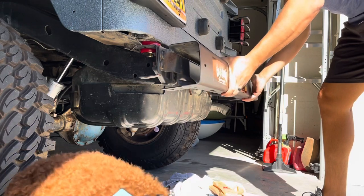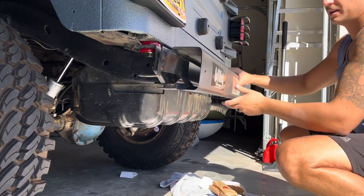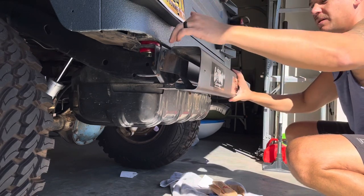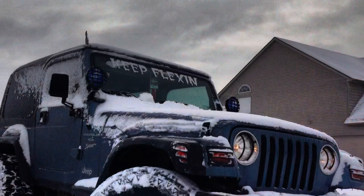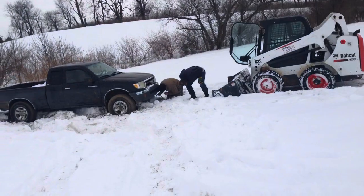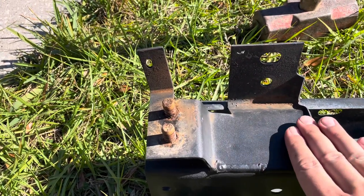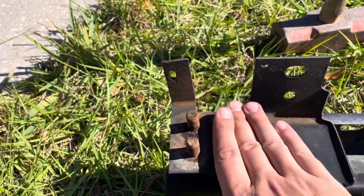You've got two nuts on each side and then you're supposed to have a bolt on the bottom — but that's flush when it's supposed to be like that. It's bowed upward. So I need to somehow bend all this back in place so I can align the bottom hole again. Here's a good angle to understand — it starts to go upwards right here; this is where it's bent and this should all be flat. We've got a slight arch, so I'm going to try to pound this back down on both sides.